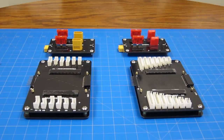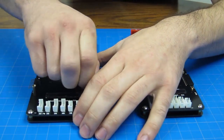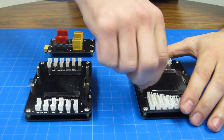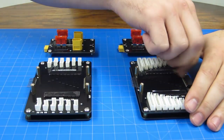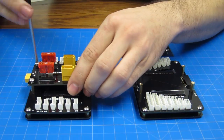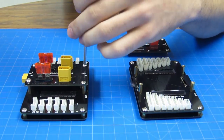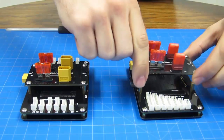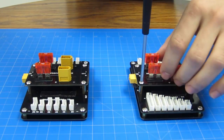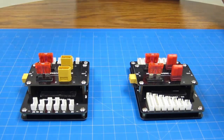While the modular balance boards can be used by themselves, they're designed to also be used with the modular charge boards. Once you have the two halves together, you can use any combination of any of the connectors available — mix and match — and then you can plug in as many batteries as you want, up to two to each set. By plugging the sets in together, you can charge as many batteries as you need to.